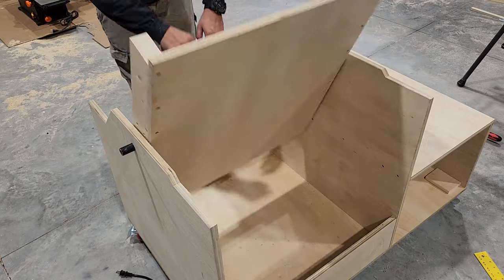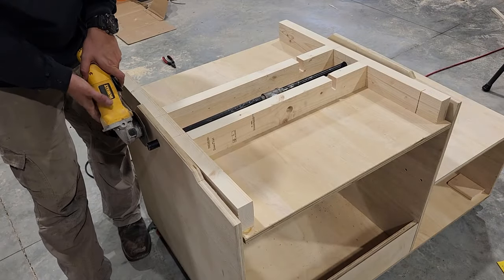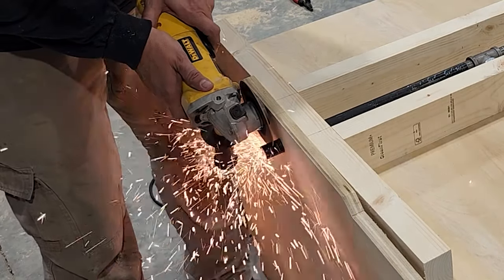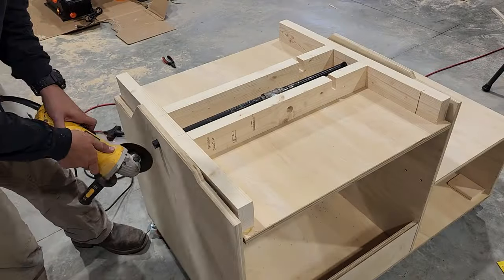And she's flipping nicely. Once I've got this fitted into place, I'm gonna cut off any excess pipe with an angle grinder. You'll want to make sure you smooth out these surfaces since you are gonna be passing an electrical wire through this.